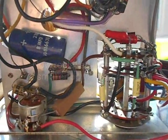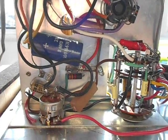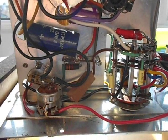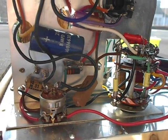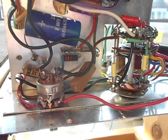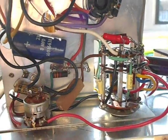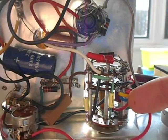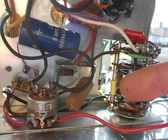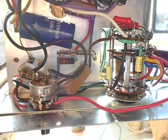I was testing it on a number of items and I noticed that the magic eye tube was quite blurry when the voltage was being turned up above 350–400 volts. Although it was still opening and closing and giving a reading, it was looking blurry — probably due to the leaky filter caps. Wax-and-paper caps tend to leak; it's just age, they don't seem to last. So I started replacing them and tested each one individually. The first one started leaking at 200 volts, and the other held up to about 275–300 volts before the magic eye would not open, indicating it was leaky.